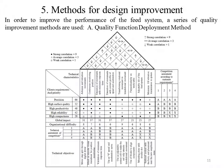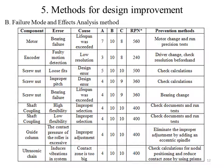In order to improve the performance of the FIT system, a series of quality improvement methods are used. A Quality Function Deployment method produced several technical objectives. The most important are: (1) attach an encoder for position monitoring or use a linear transducer; (2) use an S-shape speed and acceleration curve to ensure no shocks are induced in the system; (3) split the native step of the motor by assigning a digital driver, allowing the motor to effectuate a micro-step, increasing precision. From the Failure Mode and Effect Analysis method, several error prevention methods were adopted: (1) if the tested motor does not conform to specified requirements, it will be replaced; (2) fault in-motion detection of the encoder occurs when the resolution of the encoder and the motor don't match — to prevent such errors, the motor's resolution needs to be checked in all running modes and an appropriate encoder ordered; (3) the screw-nut mechanism may have loose fits between screw and nut due to design error or improper dimensions, where the nut doesn't make full contact with the screw, leading to precision errors.